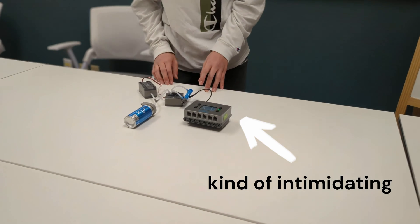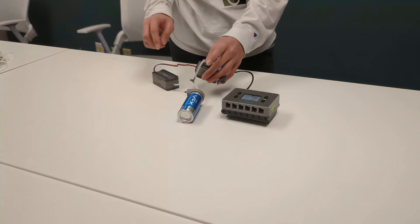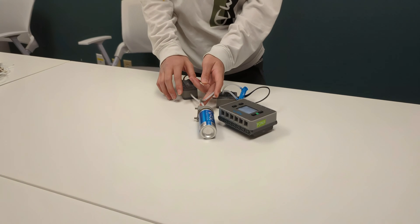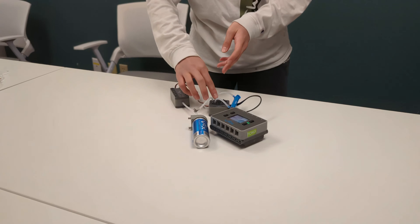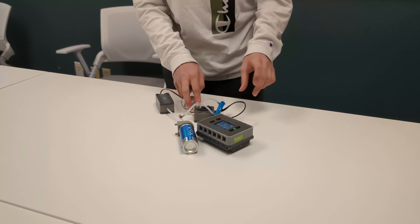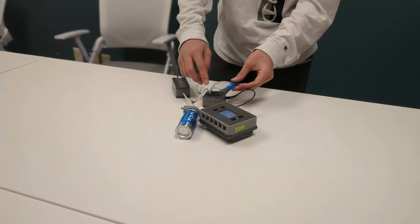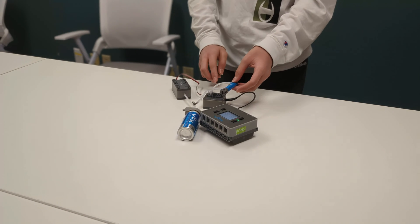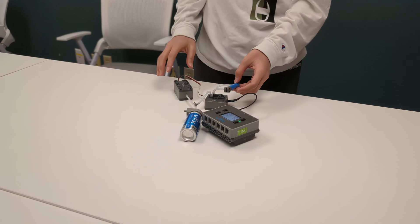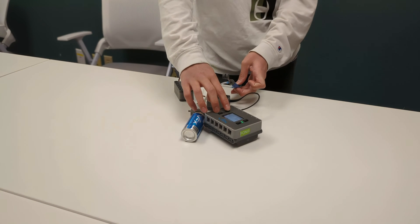These connections may look intimidating at first, but it gets really simple once you know it. This is the air pump, and behind it is a cable that connects into the solenoid. When the pump turns on, air goes through the tubing junction, which splits the air into the tank and into the solenoid. The input into the solenoid is labeled P, and this diverts airflow into A or B. You connect the solenoid to the brain using a smart cable on the side. On A and B, you connect the tubing to the cylinder, and when one side gets filled with air, it pushes the piston back and forth. If I turn on the air pump, the whole system gets pressurized, and when I turn it off, the air stored in the tank can continue to run the cylinder.